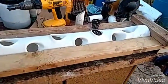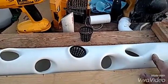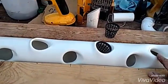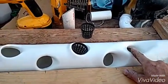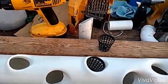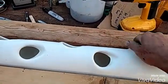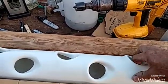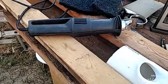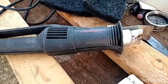I just kind of finished up on the prototype here. What I did — I used some four inch PVC, just like what a lot of people have used. My holes, instead of cutting slits across them, I used a one inch hole saw. On my jig here, I've got them marked out where each one's supposed to be. Rotate that, drill them, then heat them up. And what I used was a heat gun for peeling paint.